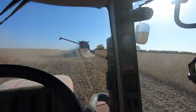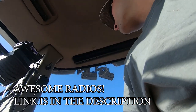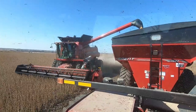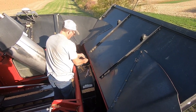It's going to be my first dump of the year right here. We are rolling. I'm going to keep it towards the back of the grain cart so we can unload that little cart in the front. I parked the truck and got back here just in time for Pat to dump, so I'm going to go out and help him switch out that yield plate — that mass flow sensor — and then we're going to calibrate our yield monitor. Let's go.